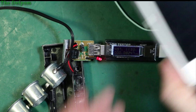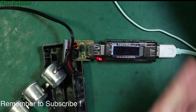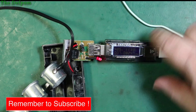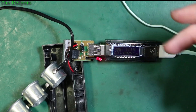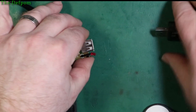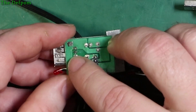And it won't charge your phone - not charging, no charge. So I'm looking at this and obviously you've got power, so it must be data lines. Let's check the power after this. And on the data lines on the connector, there's no connections.